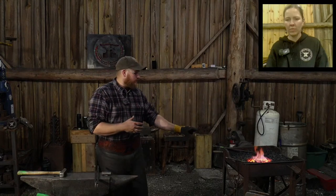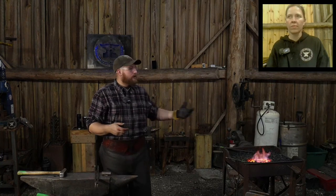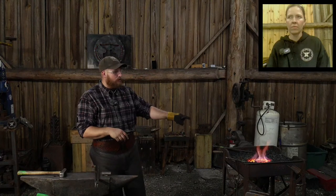The second reason why axes are created this way is because when you punch wrought iron, it doesn't perform like mild steel. Because there's grain orientation, like a chunk of wood, when you punch down through, say with something like a slitting tool, where it's a long slot, and then you drift something open in that grain, what are you doing? You're splitting along the seam of that grain, right? And so what would happen is at the very end, as you see on the pole of the axe back here, it would split out. So they just didn't do it. It's not the right way of doing it.